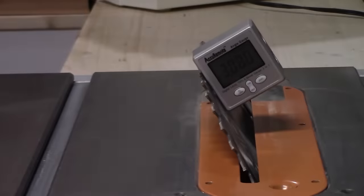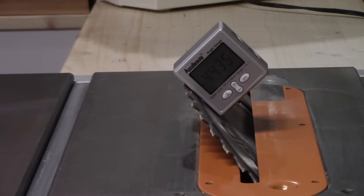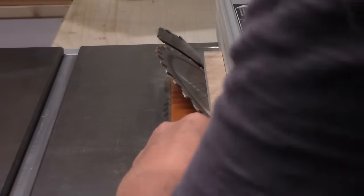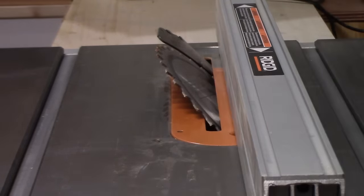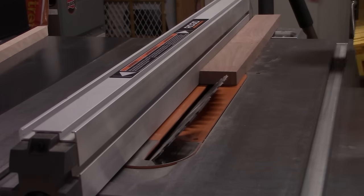Now I'm ready to work on the walnut and maple pieces, both of the same dimensions as the red oak, 2 inches wide by 3/4 of an inch thick. I'm setting my table saw blade to 45 degrees to make a single cut the full length of each piece of walnut and maple. When setting my fence, I'll use one of the pieces of red oak that has been sanded square. I want the remaining face of the walnut and maple pieces to be the exact same dimension as the square face of the red oak.